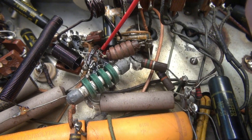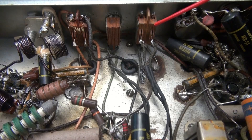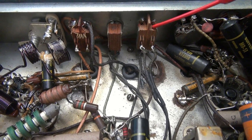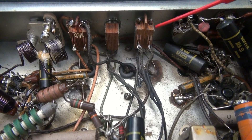I changed out the cap and fixed the arcing situation. Then I measured the carrier switch — it's a double-pole switch — and noticed it is open. So that's probably why it's not transmitting. I'm going to change out the switch.